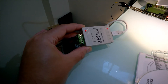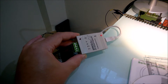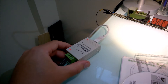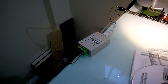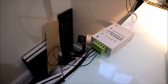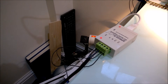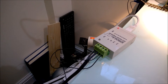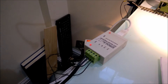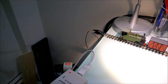Here we've got the Sprog 2 version 3 USB module for programming DCC chips. As you can see it comes with a USB cable that plugs into your USB port, and it's got four quite simple to connect outlets. One is 10 to 20 volt DC in — mine is 16 volt DC — and then the other is two wires that go to your track to power it.